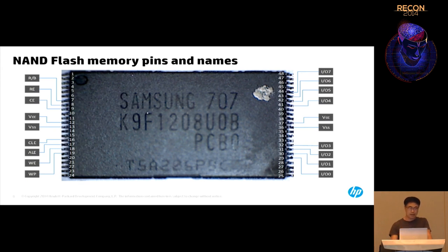The NAND flash has many manufacturers with slightly different standards. But out of 48 pins, certain pins are supported by most of them. On the right side, there are IO lines IO0 through IO7 — eight IO lines for 8-bit IO. There are VCC and VSS lines for power supply at 3.3 volts. The other pins on the left side control IO or define data types.